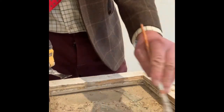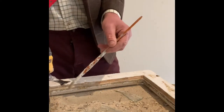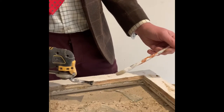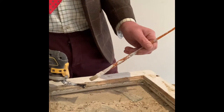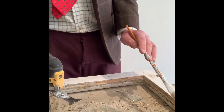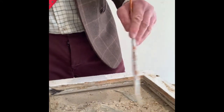What we're going to do next is put some paint on the bare wood. Two reasons really: one is if you put linseed oil putty onto the wood, the wood will soak up the linseed oil and it might make the putty crack and then water will get in. Also, if you paint these rebates, if any water does get in, it's going to run out and not soak into the wood. So you really want to get a coat of paint on before you put the glass in. I'm going to get a bit of sandpaper, sand them around a bit, then put some paint on.